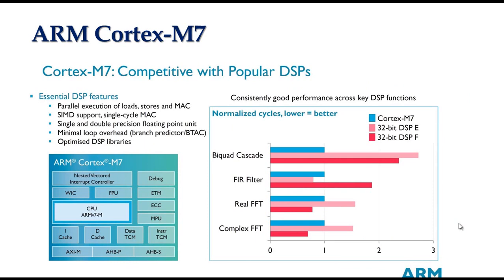According to ARM's benchmarking, the M7 achieves 5 CoreMark per MHz, or a 2000 CoreMark score at 400 MHz in a 40nm process at low power, if you run the code in tightly coupled memory. The M4 can hit 3.4 CoreMark per MHz according to previous ARM figures and runs at lower clock speeds. The M7 can scale up to 800 MHz at 28nm.